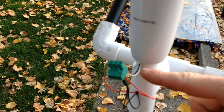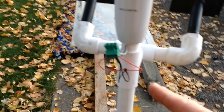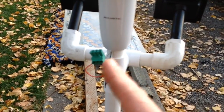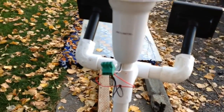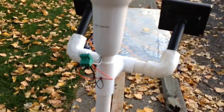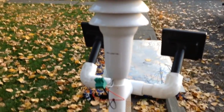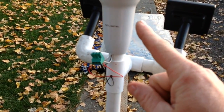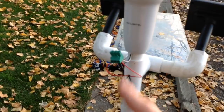You may notice there are three wires coming out of here — one ground and two positives. The way the batteries were arranged was series-parallel, divided into two 3-volt sections. At the top of the battery compartment when I pulled it apart, there were two red wires: one going to battery one on the circuit board and the other to battery two. So I ran each individual solar panel to one side of battery one and the other to battery two, with both grounds tied together as a common ground.